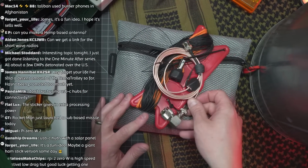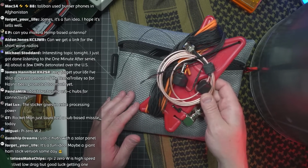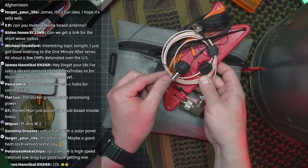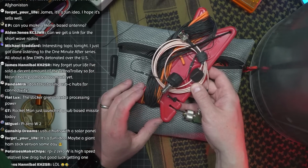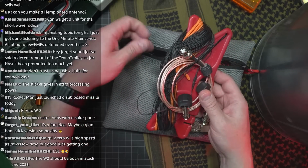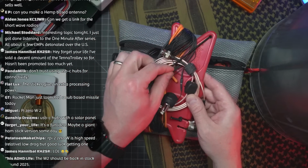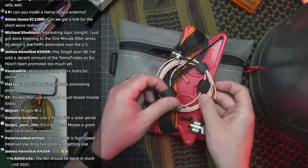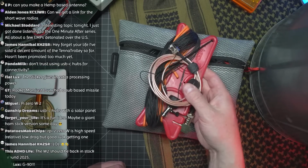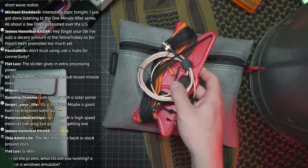All right, so the antenna that I'm planning on going with, for the HF radio that I have selected, which some of you probably already know what it is. This is a special antenna that K6ARK built for me, actually. It's specifically designed to handle the 20 watts of the soon-to-be-mentioned HF radio that still lives in this kit with good reason, I feel. It is BNC capable, though, so you could connect this to any QRP, and it is his 9-to-1 option, which means that you will need to leverage a tuner, and it just so happens that the radio in question, no spoiler alerts, has that capability. So that's the antenna that I'm going to use. It's small, it's lightweight. It can be easily aligned vertically, as a sloper, or horizontally off the ground, like for an NVIS solution.